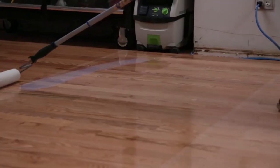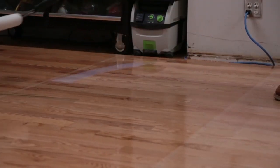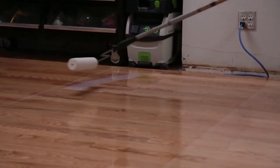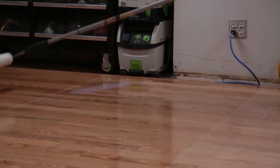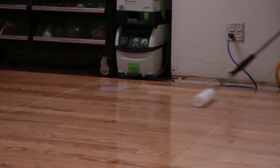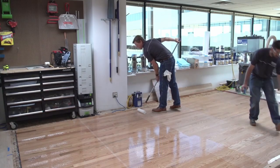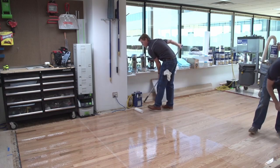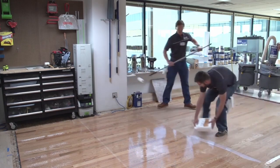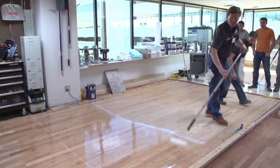The original method — back and forth in the same pass, move over no more than half a roller, and roll it forward. When you wet it out first you just have to be aware of where that product is, where you stop and start. Who rolls? Got a couple of rollers — any different techniques? Rolling with the grain of the wood. There's not really a wrong way or a right way — these are best practices and methods that we can use.